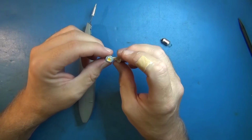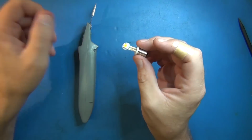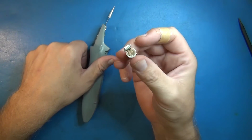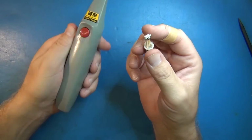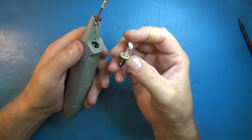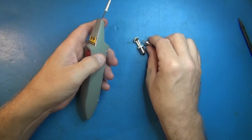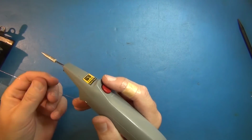I'll cover that later. I know that I can make it work because I've already done the circuit math on it. But the thing is, this isn't even going to light unless you're at like 2.5 to 2.7 volts once I do the mod. And unfortunately, this is going to go down in voltage a little bit, and then this is going to turn off. So without creating a constant current circuit that stuffs in here, there's probably no good way to just quickly mod this. So that's the mod. Well, this is the first time use. You always want to tin a new tip so they stay good.